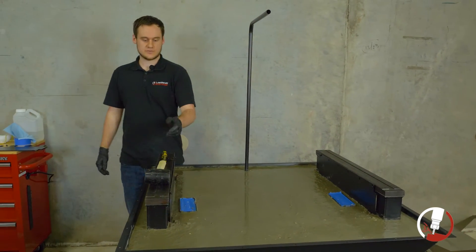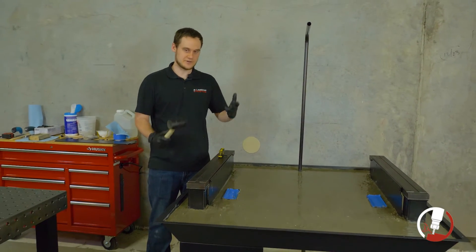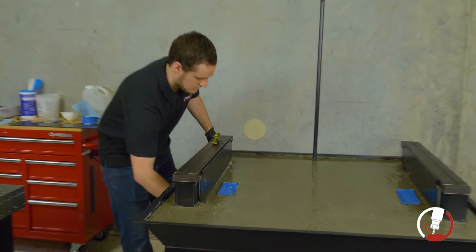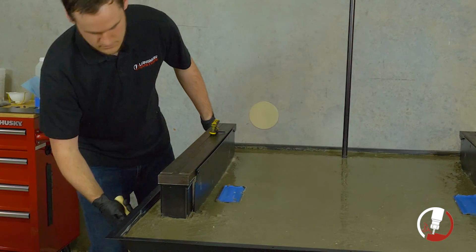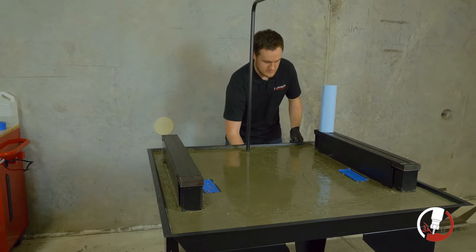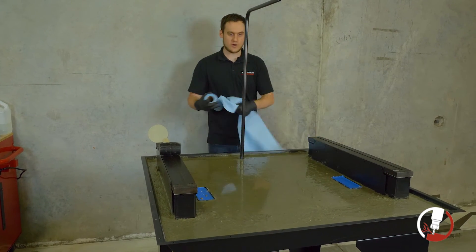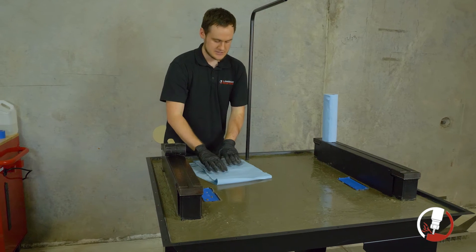After getting the Y-axis rails in, we continue tamping with the mallet to bring water up and out of the concrete, ensuring strong concrete and avoiding a milky finish. Give the tray a few taps underneath, then use shop towels or any old rags to soak up the water that comes up. The process is: tamp, soak up water, and tamp again until you get absolutely everything out.